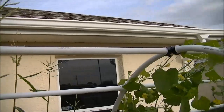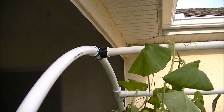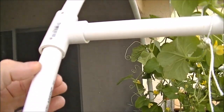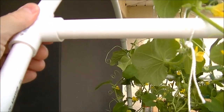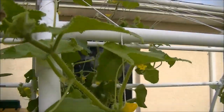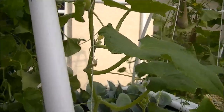After doing four of them it dawned on me that if I had just used a technique from building my aquaponic system — drilling out with a Forstner bit — I could get the connector to slip right onto the pipe. That's what I did with these: drilled through with a Forstner bit just big enough for the pipe to fit through. Depending on how straight the drill is, sometimes it's a snug fit, other times a little looser. If it's loose I use clips cut from three-quarter-inch PVC — they clip on tightly to the half-inch PVC and work great.